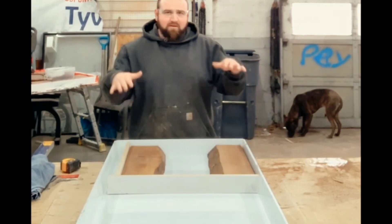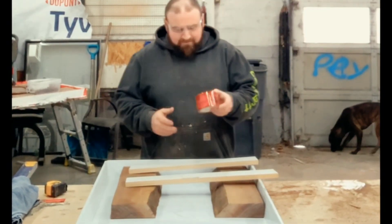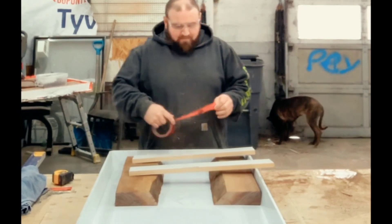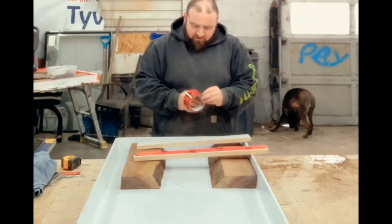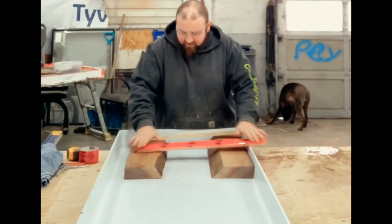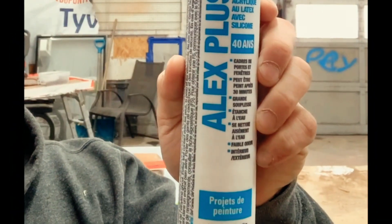Now that I've got my pieces for my little perimeter, I'm gonna tape them and put some tuck tape on them. Here in Canada we have tuck tape, also called Tyvek tape — sometimes it'll be white. If you're using metal molds, you can just put some mold release spray on it. But these are some old scrap pieces of white tinted trim wood, so I'm gonna cover them in tuck tape, because epoxy will not let go of that wood even with mold release. To seal it up, I like to use just a paintable caulking — I find you never have leaks with it and it doesn't stick to the epoxy.